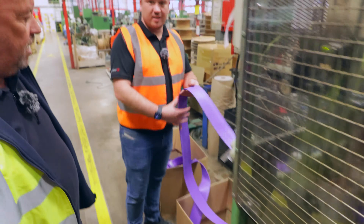What about the rolls, Alan? We do the rolls as well — they'll be manufactured over here. Same principle as the coils, but we're winding these by hand. The problem we've had with an automated winder is the layering and also getting the cling wrap straight through it, so we've always found it's easier for the operator to manually operate this machine. It cuts at 100 metres and then we get the roll.